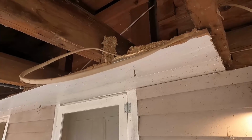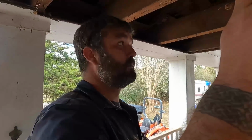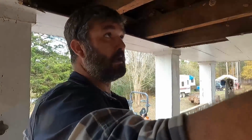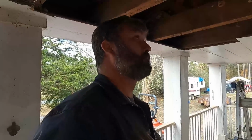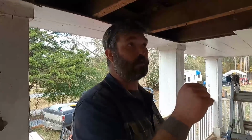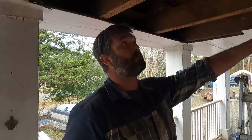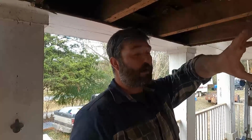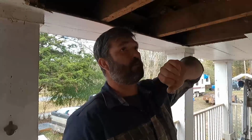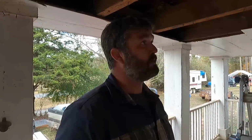So I've got my multimeter, and I'm gonna go up. I'm gonna turn off the breakers. I'm gonna go through this door to the breaker box, and when Robert yells that this light is off, thinking that should be the power, but I'm not gonna believe it. So I'll show you guys how to use a multimeter and go through the insulation safely to check your power. Once we know all the power's off to all these wires, which is probably one circuit, but once I know it's all off, then we'll go over rerouting and how to fix all this stuff safely and make sure it's good to go.